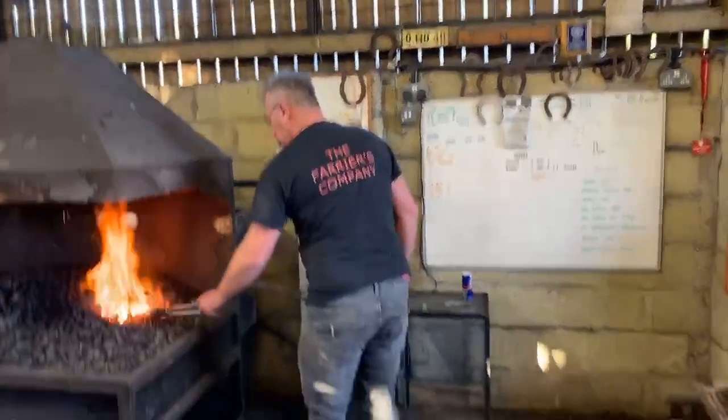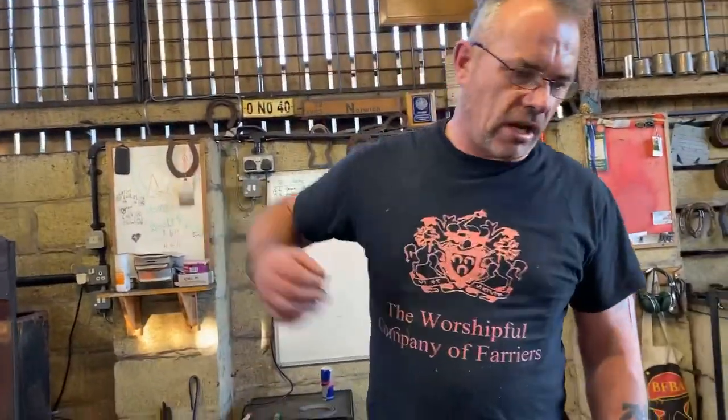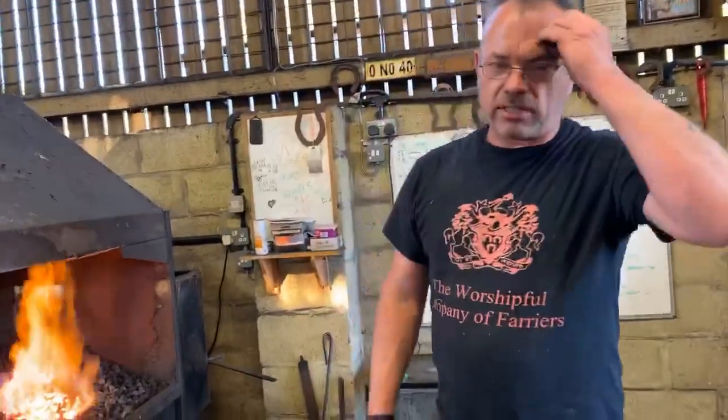Lastly, we'll do the same, this flat shoe. It's exactly the same technique, except you've not got the concave border to worry about. But it is important that you do go around the inside edge with your file just to make it flow. You don't want to over round it because then you'll lose the definition. But you certainly want to just, at the correct angle, round that sharp edge off. Examiners, assessors, judges don't like it when they pick up shoes and they're razor sharp on the corners. If it's razor sharp in the hands, if a horse catches itself, it's going to do itself an injury.